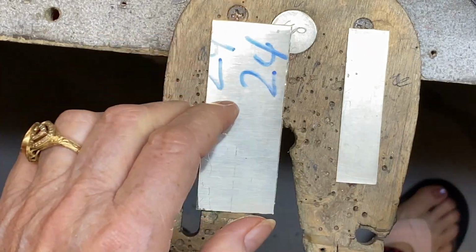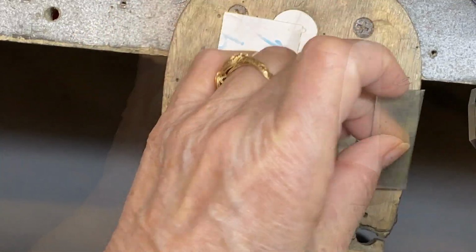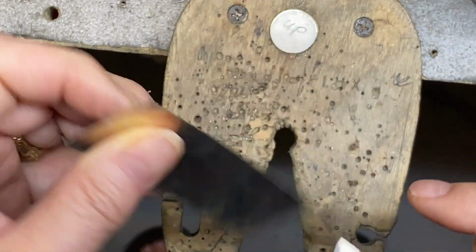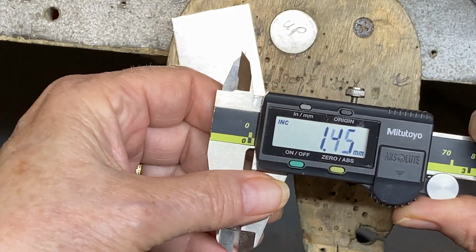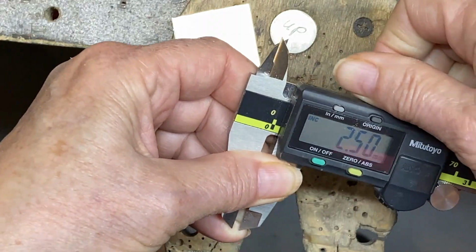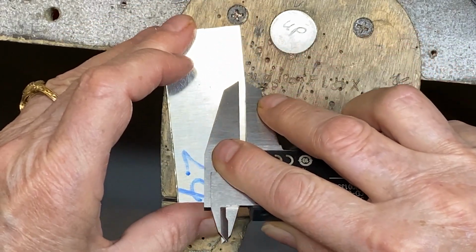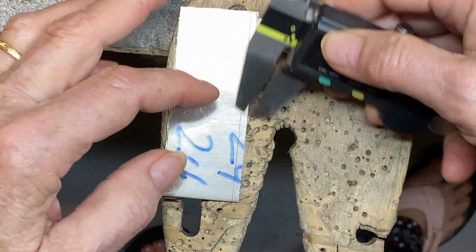What we want to do is, this is my inner bezel, this 24 gauge sterling here. So that's going to be 2.5. And what I want to do is use my square edge over here, which hopefully is square. The most accurate way is to set your calipers to 2.5. And I have found that dragging towards yourself is more accurate, and I don't slide off. When I go like this, for some reason, I tend to slide off.